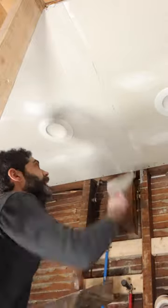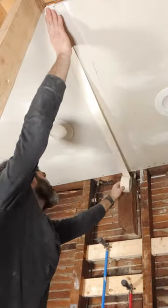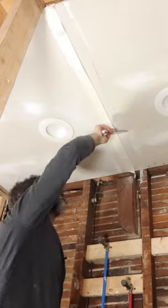An hour and a half later, I applied more joint compound over the butt joint, added my tape, and added my second coat over top of the screw holes. This is by far one of the best ways to speed up the installation.